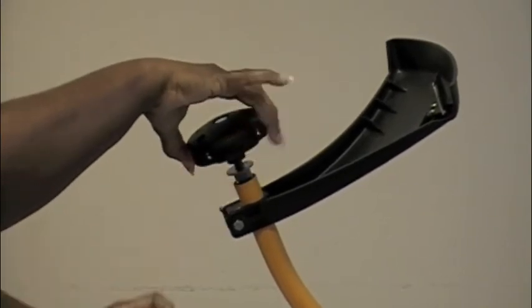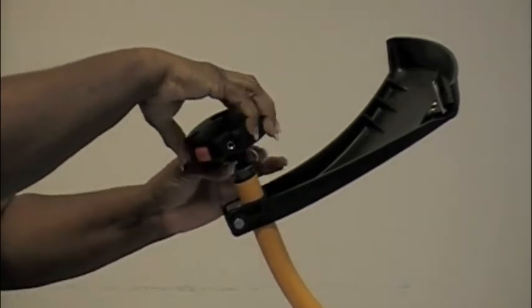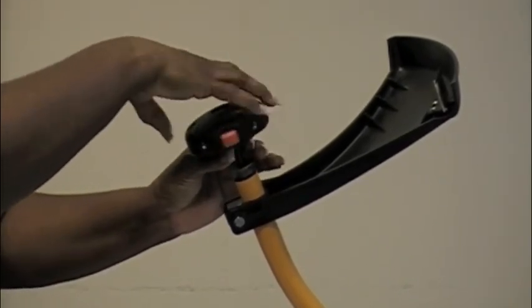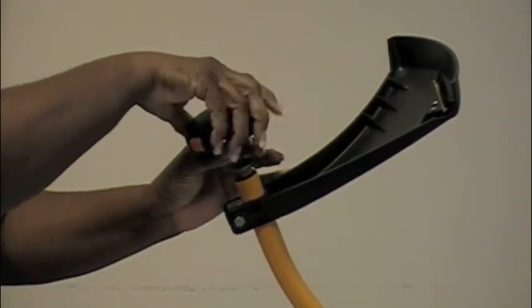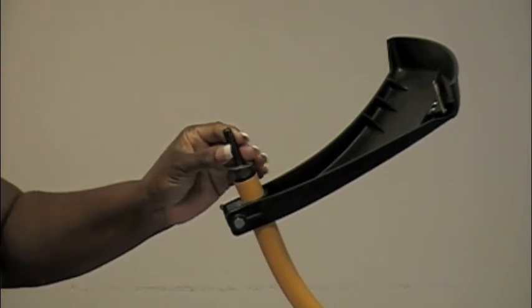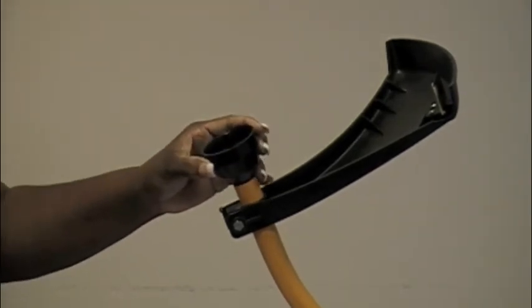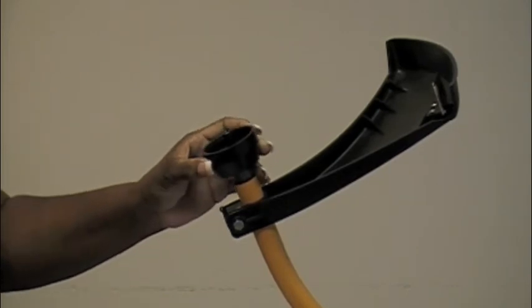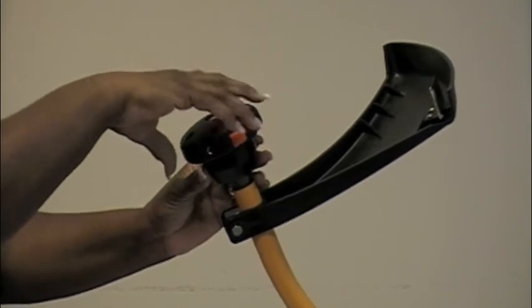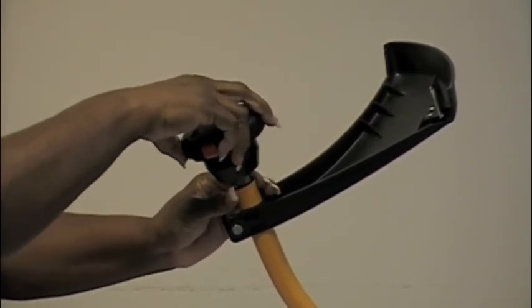After you have attached the head, if you notice that there's still play between the trimmer head and the shaft and it moves up and down freely, go ahead and take the head back off. Now place either the plastic washer or the plastic cup provided over the female bolt end, and put the head back on. Make sure the head gets tightened securely.